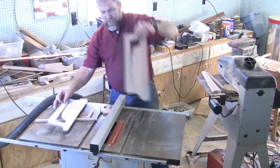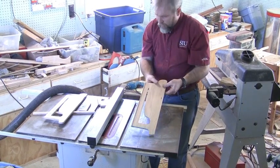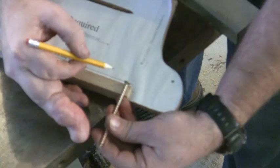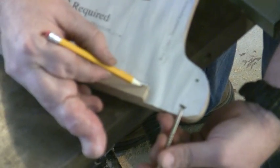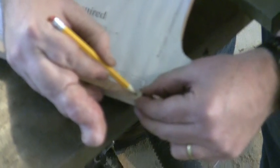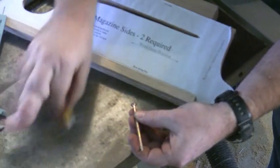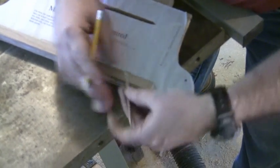Make sure we have them both on the right side — there's just a little slot for the cover to slide into. To build the trigger mechanism, the trigger is going to sit right here, and when the magazine comes down, it's going to lift the bowstring off the slot. I need to drill a hole right across here. We're going to drill a hole and then do a little countersink to fit that pin in. We're also going to cut the pin off to the 13/16 inches called for in the plan — just a little bit more than is necessary to lift that up into that spot.